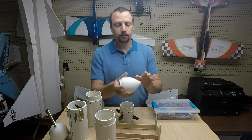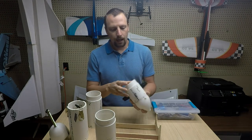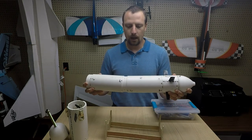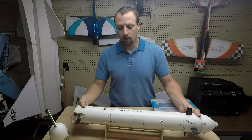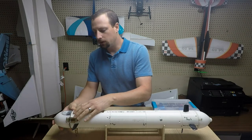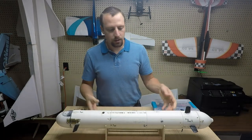Then we have the tail cone — it's just a slightly different shape, it's got the hole in it, a bushing for the shaft to go through, and then the prop off the tail. All of these sections were held together with screws and just slide together. I actually turned all these down on the lathe as well to get the stepped tube sections. This is made from just three-inch PVC pipe — three-inch ID and three-and-a-half-inch OD. It works quite well. I didn't have any problems with leakage. Between each section I put silicone seal, and of course the O-ring on the nose section, and it all worked out quite nicely.